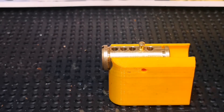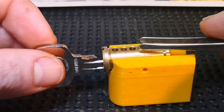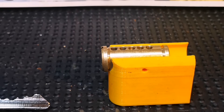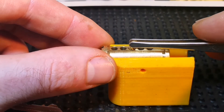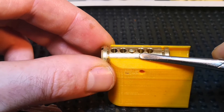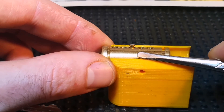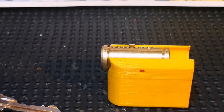It's a real shame that this lock has slipped through quality control. If we take this out and put it into chamber three — we know that one's been drilled correctly — as you can see it's gone all the way down. When we put the spool on top, look at that: that would have been fully interactive. That's how chamber four should have been. This defect has effectively turned it from having two security driver pins to only having one driver pin — it's almost turned it into a four-pin lock.